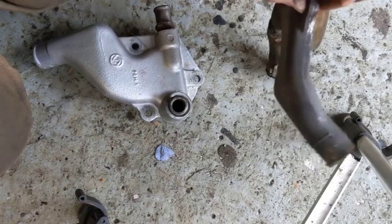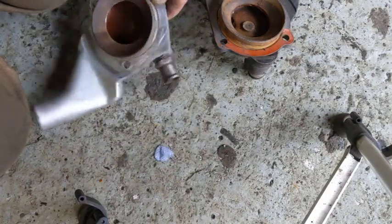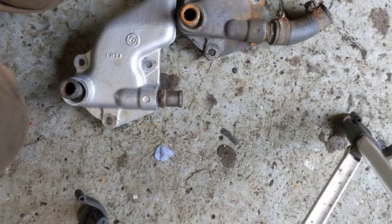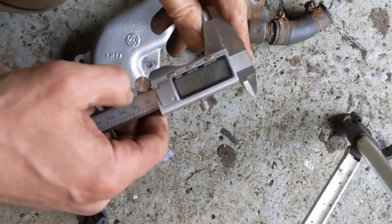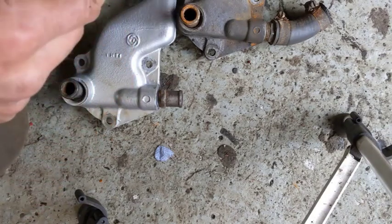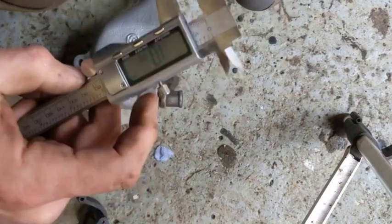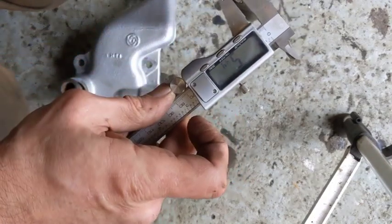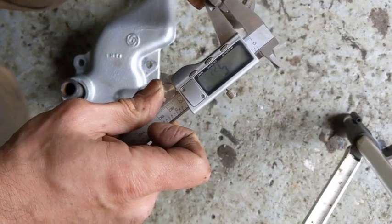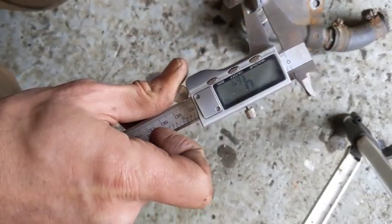What I'm wondering is if this thickness here is different to the same one here. So we're going to pick a couple of points. I want it in millimeters - I find that easier. So that is 5.39, about 5.3. When I'm putting pressure on it, 5.22. And this one - 4.6. Wow, look at that difference. Let's try over here. So we've got 7.77 and 8.25.